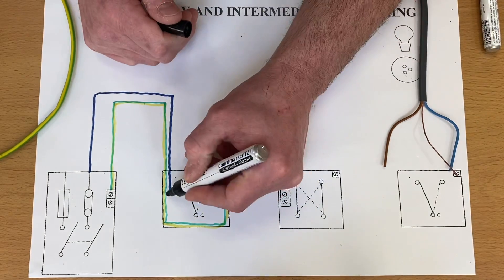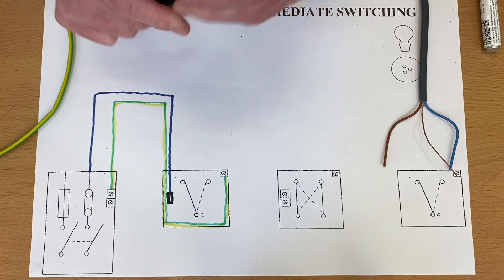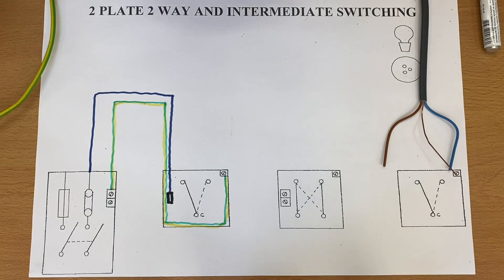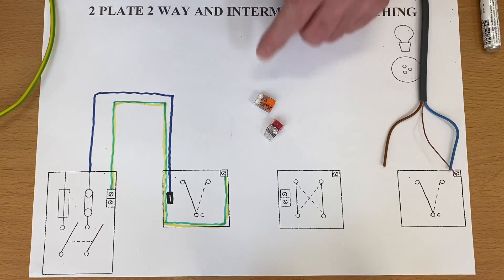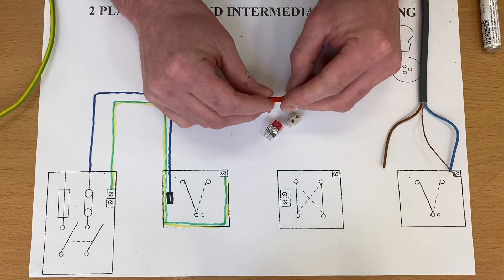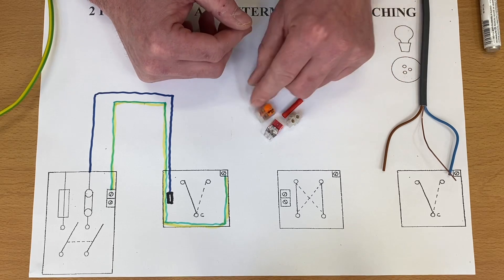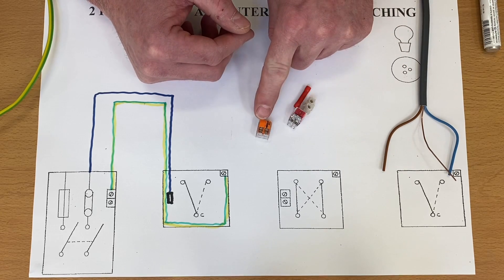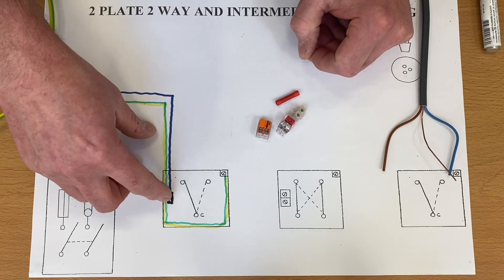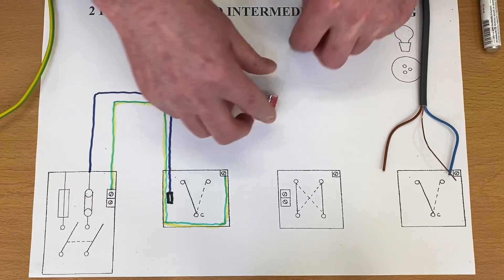I'll show that connection in the form of a little rectangle — in other words, a connector. That could be a levered connector from Ideal Industries or Wago, a screwed connector, an old-fashioned five-amp connector, or a through-butt or splice crimp. Generally at college we've been using the levered variety of Wago connectors to make our connection, but any of those would be acceptable to make a connection in the back of the box for the neutral.